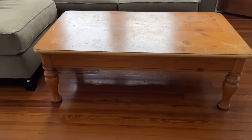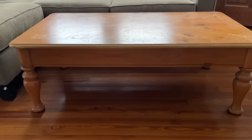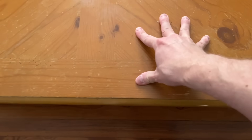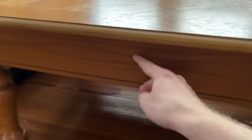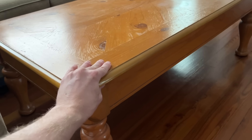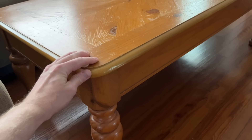And if you start looking around, you'll see this effect everywhere. Many dining tables and coffee tables incorporate it. The tabletop itself might be quite thin and can never support much weight over multiple feet. But by adding a simple skirt piece turned on edge, the builder creates more than enough span strength. And they also create greater shear strength too, which keeps the table from wobbling.